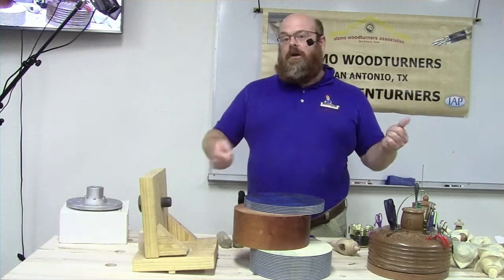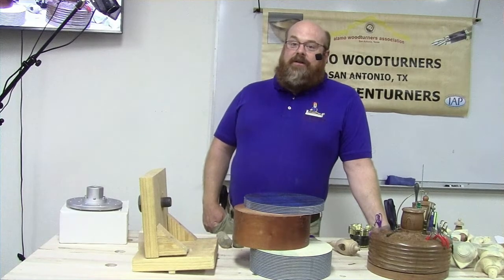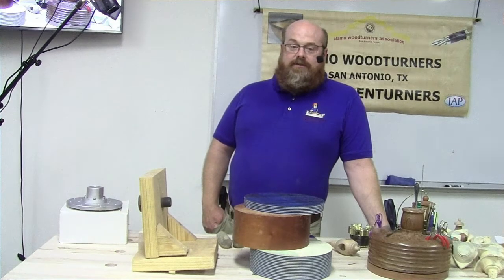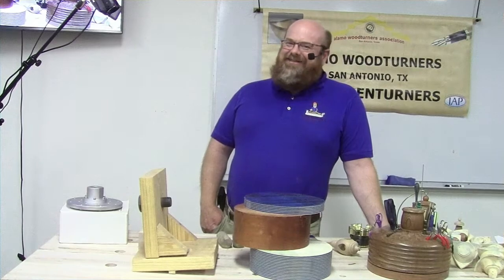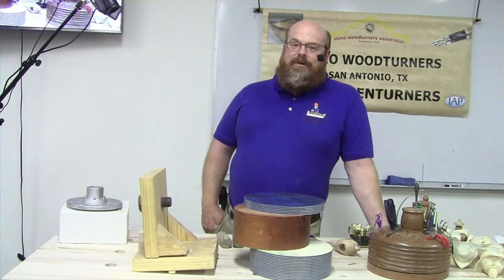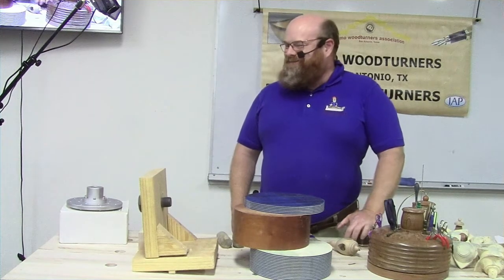I had to break out my Easy Wood carbides, and I could get through it. But I promise you, I had to rotate my cutter when I was done with that, because I don't know what that stuff was made from. You could sandblast the heck out of something with it because it would rip everything apart. It's brutal stuff. That was one of the few times when I was like, okay, carbides it is. It's a very soft mineral, but it's still got enough silica in it that it'll tear your tools up pretty quick. It depends on what you're cutting. There are too many things you can add. It's when you add stuff to wood that it gets really crazy.